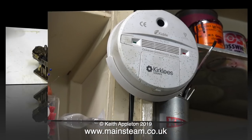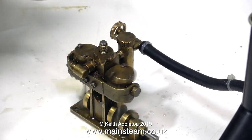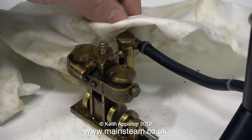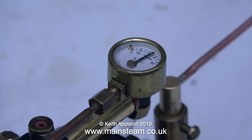Health and safety warning: do not run these kind of gas plants indoors. I'm trying to show the most effective way to kill myself so that you don't have to. After the deadly carbon monoxide dissipated, I removed the number 10 jet because that was far too big. This time I fitted a known good number 5 jet, and this was far better - much more heat, no smell, and no carbon monoxide alarm going off.